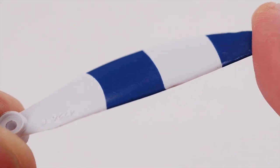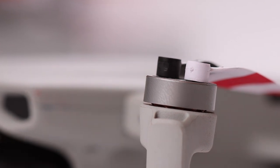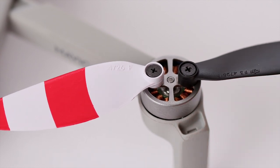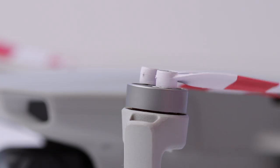The general build quality of these props seems good. I do find they feel a bit more stiff, perhaps even more brittle, compared to the DJI parts. During installation I found the screws were a little more difficult to get in, and I don't know if that's a quality issue or just too much thread lock on the screws. The overall fit and finish is just not as good as the DJI propellers — zooming in you can see rougher edges and the fit is not as precise. When the screws are tightened down you can also see a lot more movement with the third-party propellers, and that extra play did not seem to impact flight, but I can't help wondering if it will cause issues over time or cause the propellers to wear out sooner.